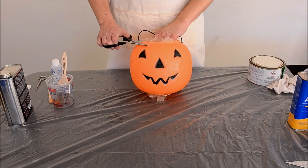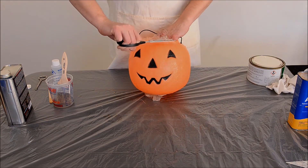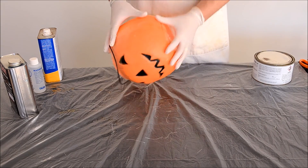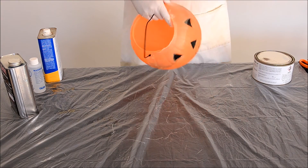The excess fiberglass can be trimmed once the resin has reached the green stage. This is when the resin has somewhat hardened but is still tacky. Use scissors or a razor blade to trim the fiberglass. Allow the part to fully cure. When removing the part, typically a wedge is used to help force the two pieces apart, though it isn't necessary on this part.